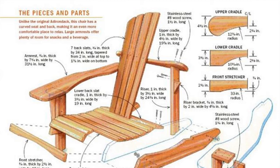3. Turn the back legs so the angled ends are at the top, tilting down away from the rest of the chair. Attach the bottoms on the inside of the base rails about 2 inches from the ends with nails. Lay the top back rail across the back legs and trim, if necessary, to fit flush. Attach the top back rail to the legs with galvanized screws and attach the back legs to the insides of the base rail with countersunk deck screws, removing holding nails as you go.